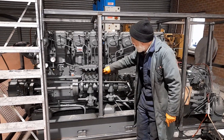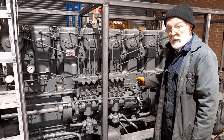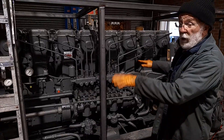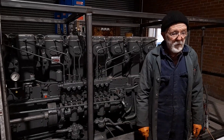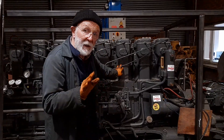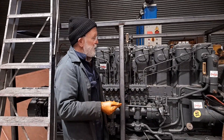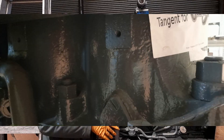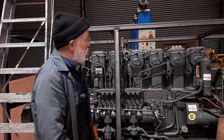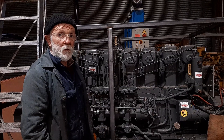The throttle box is actually missing from this engine because it was broken when it came here, which is why I was controlling the revs manually. I can't run it for too long because there's no coolant inside her, and I don't want too many fumes in the workshop. A very interesting feature is there are no head gaskets — between the head and the block, all it is are O-rings on the liner. If those O-rings ever leak, the coolant will show itself through a small hole on the far side of the block, giving you a warning. The whole liner will pop out quite easily and is very easy to replace. Another great score for Gardner.